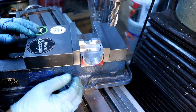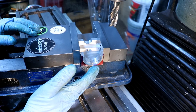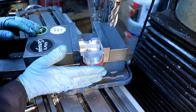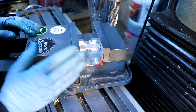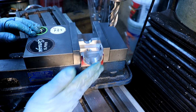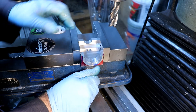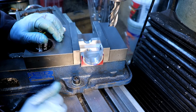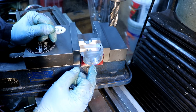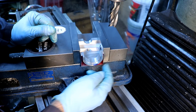I'm ready to cut the cams. I have a mark here of where the point of the cam should end up. This is 15.7 degrees. I've set my vise over at 15.7. We're just going to come in with the end mill and cut that off, cut that back until it's close back here, but the point is out here right at that line. You can probably barely see that mark — it's just about not quite a quarter of an inch to the side there, a little less than an inch from the edge.